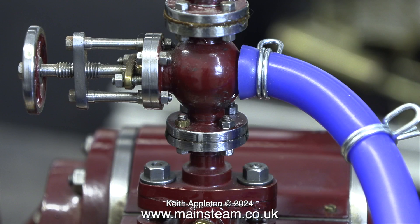I'm performing these initial tests so I can estimate the cost to build this engine into a steam plant. I'm concerned about a few things on the engine — nothing really serious — but the steam tap leaks on every junction, including the flange where it's bolted to the engine itself. This is a very simple fault and it wouldn't take long to rectify. But all these little jobs add up to a big job, and that's assuming everything comes apart okay.